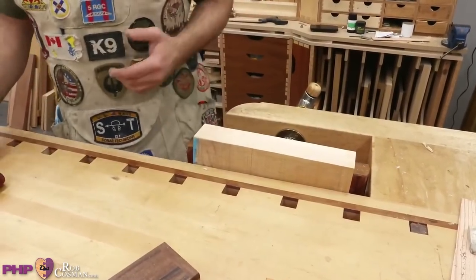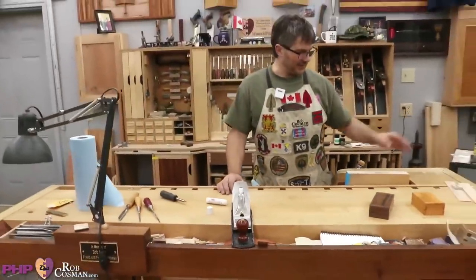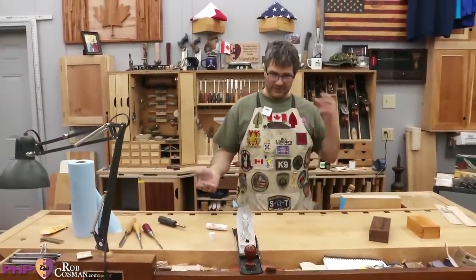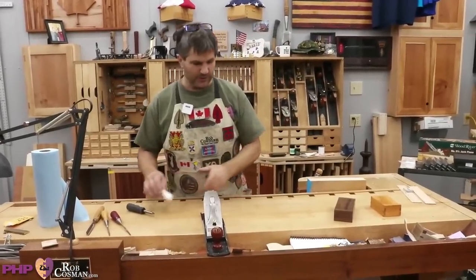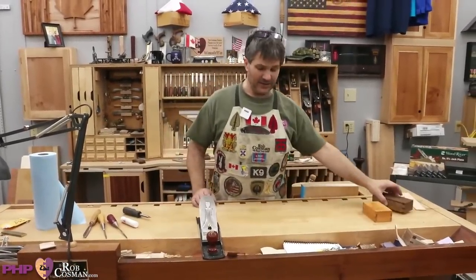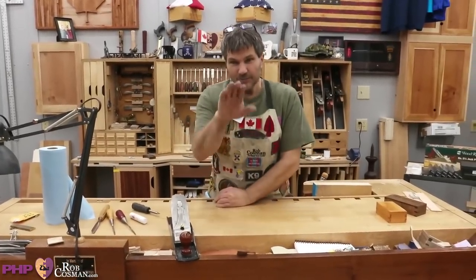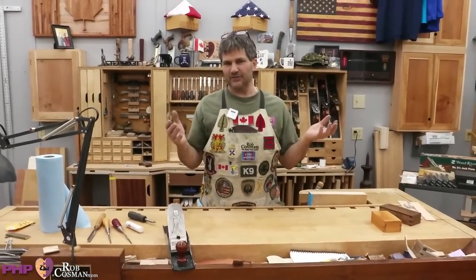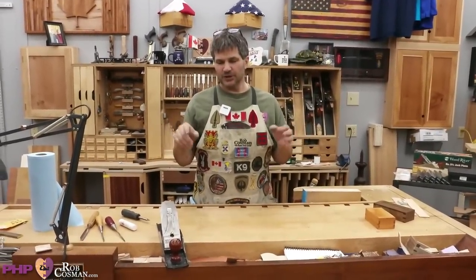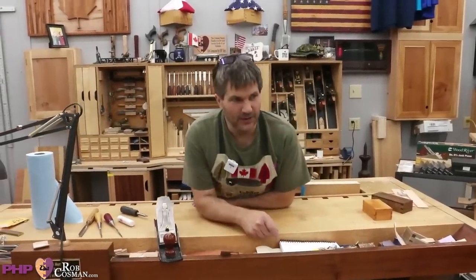So the question was, do I strop? Well, if you're investing 32 seconds and you're getting this, why do anything different? Why add anything to that? It's not going to make it better to where you can tell if it even does. And you have that disadvantage, I think, of changing the shape. We're not sharpening a hunting knife or a steak knife. We're sharpening something that I want to produce a dead flat surface. That's the reason why. Next question, Frick.